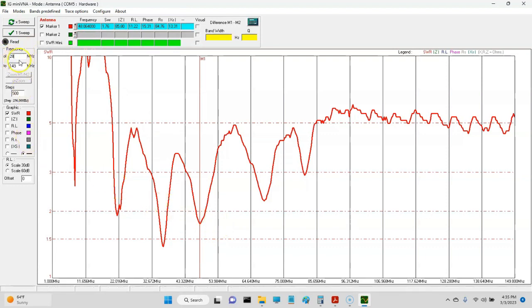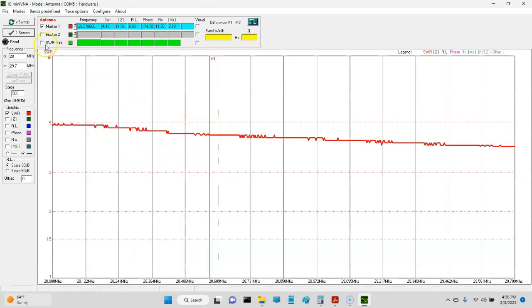I just wanted to show you this video — if things go wrong, I want to show you what to look for, particularly that SWR meter on your radio. Get an inline SWR meter, because those things are critical. I could have kept transmitting because the radio does throttle back the power, and if you're not paying attention to the SWR I could keep talking for months and only be putting out a quarter of the power I could. But that throttling back is creating heat in the radio, which can potentially damage it. So pay attention to your SWRs and have a good day.